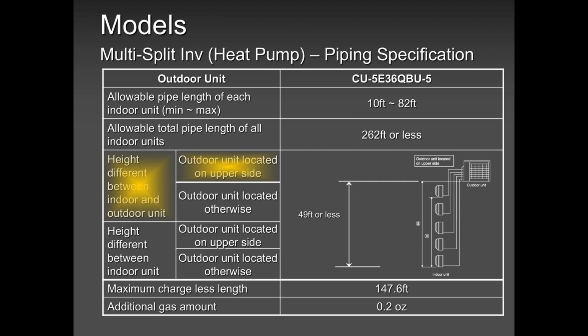And there is always a difference between when the unit is up, when the unit is down, when the unit is in the middle. But I'll tell you, from my installation experience and service experience, always when the outer unit was in a balanced spot. I understand, guys, sometimes it's not easy. Sometimes there is no room. Sometimes there is no place to put that outer unit. But always make the best judgment of your life to put that outer unit, because remember, that outer unit is the heart of that system.